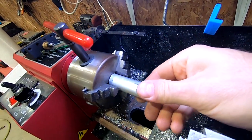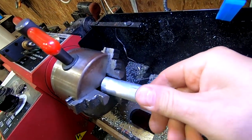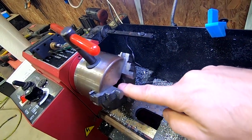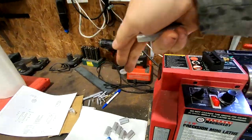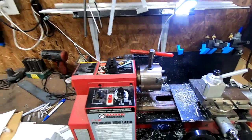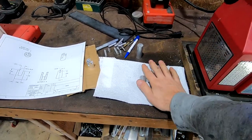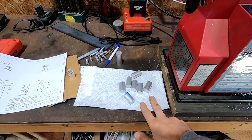Here's what I meant when I said it can't fit through the center bore — you can see how it's kind of close. Obviously a larger lathe would have a larger hole there and you could just feed the whole stock through the end of the machine. I was able to get seven cut plus this little chunk, so let's start turning these down and move through them.